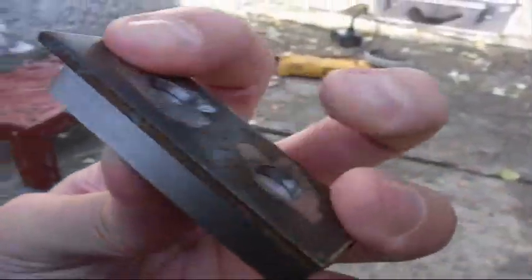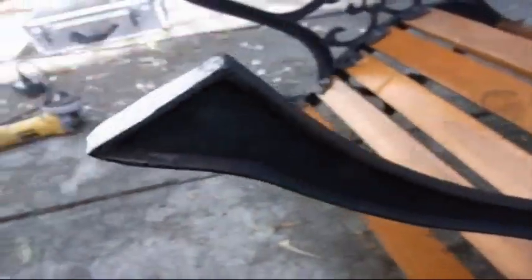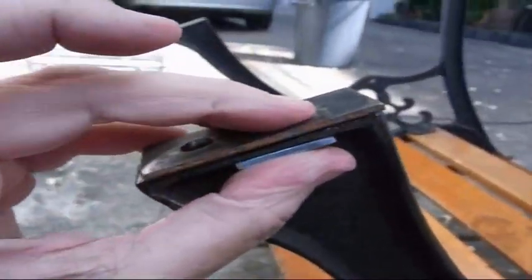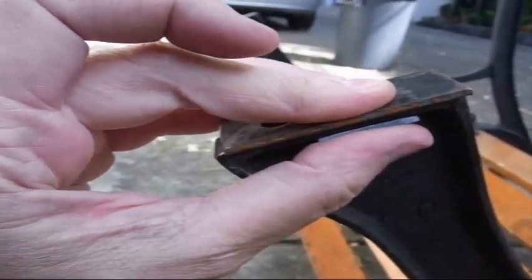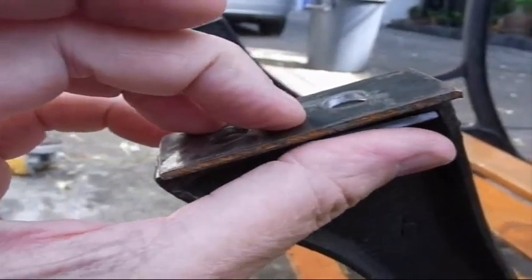Here's what I've got so far. I've got this piece of metal and I've drilled my holes in it so I can weld the stainless on there through those holes in the back. Then that will go on here. And I've got these little pieces of metal that will go underneath like that. Then I will weld along that gap — in essence I'm just making a shoe with a stainless steel piece on it, and I think it will be clearer once I get this piece welded up.